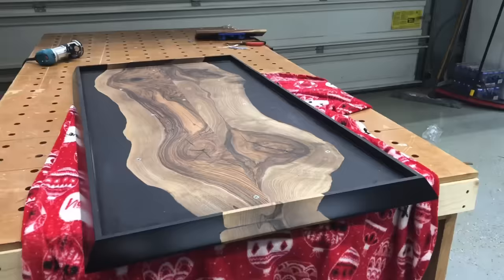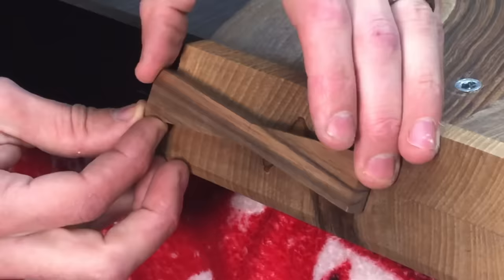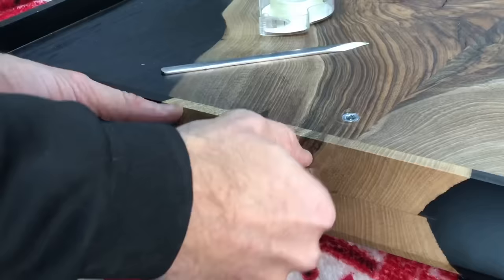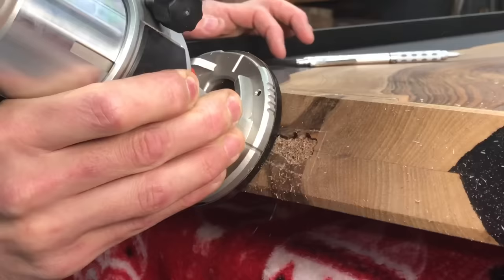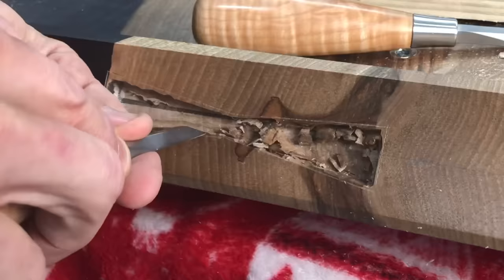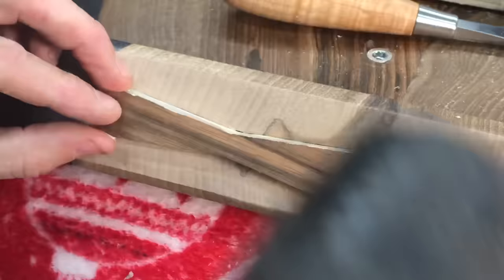I had it all completely finished, and there is this black epoxy seam that I just couldn't ignore. I thought it was going to go away, but I can't hide it, so I have to do something — the table's completely finished and I have to cover that up. The most I could think of was to put a bow tie there. I generally like to have a bow tie where it's more traditionally necessary, like in a crack, but it's all I could think of to cover that particular blemish. What it was, was just a little bit of black resin left after planing, and when I flipped the edge over it basically doubled the thickness and made it really visible. So I had to get a little bit creative with my trim router to route that out and get the chisels out. I actually have a detailed video on bow ties and another on the inlay process — I'll include links in the description.